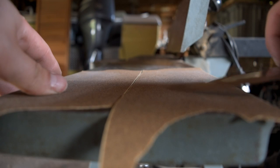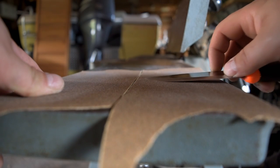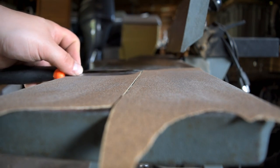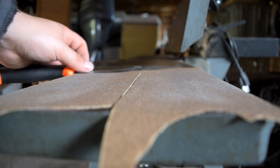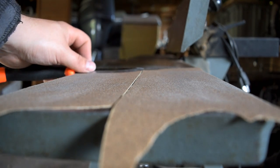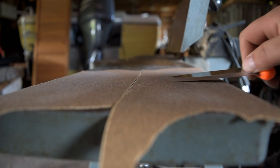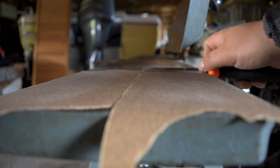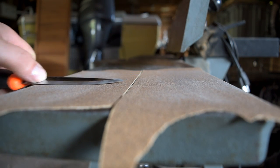I'm just about finished up with the 100. My last strokes are going to be just into the edge — a few strokes on each side. I'll do four on each side, then three, then two, then maybe a few ones. Keeping consistent on that angle and decreasing pressure — I find this helps pull away that burr, especially if I switch back and forth a few times, because if I do it a few times on one side it seems like sometimes it rolls the burr under, and then switching over just helps grab it and pull it off.